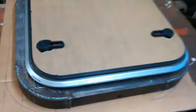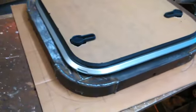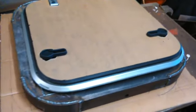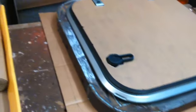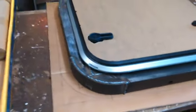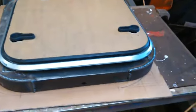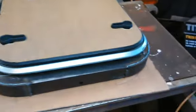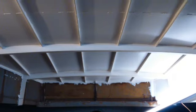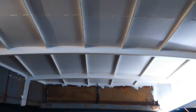When I get everything bolted up - when the framework is welded into the top, obviously the hatch will get mounted in there. What I'm going to do is, because it's 5mm angle, I'm just going to tap the angle for the screws so I don't have to muck about with nuts inside once I'm panelled in - so it can be taken out without removing panels. Tap the holes out, stainless screws in, put a bit of grease on them so hopefully they'll come back out if ever need be. So that's today's job - get that ground up, cleaned up, get these edges nicely curved, and get the hole cut up in there. It's starting to warm up a little bit outside. See if I can get that hole cut in there, get it ground off, cut a primer before it goes in, and jobs are done. So there you are, there's a bit of an update for you.